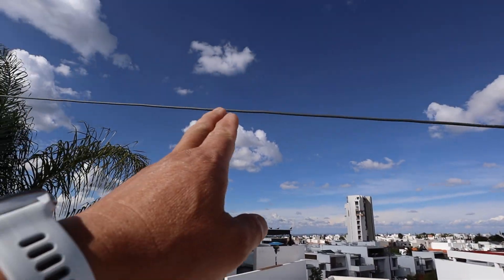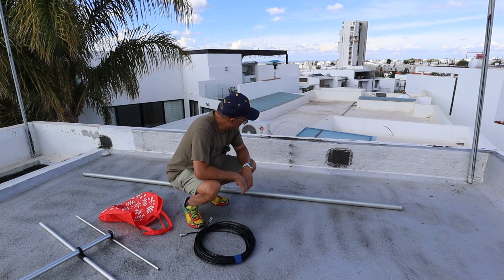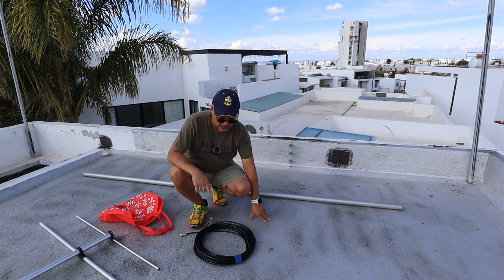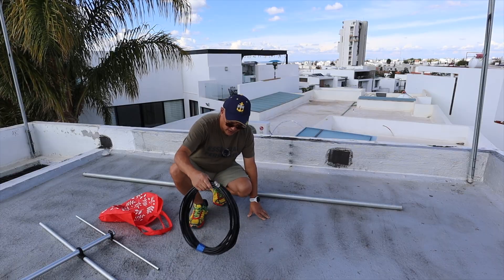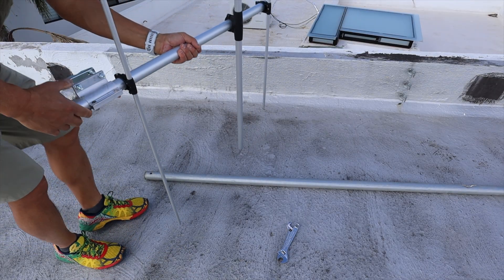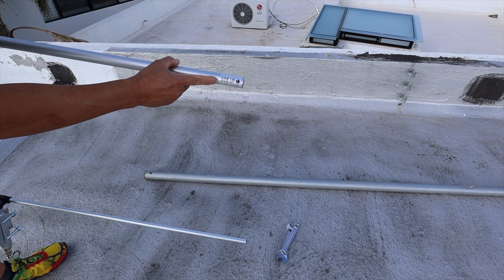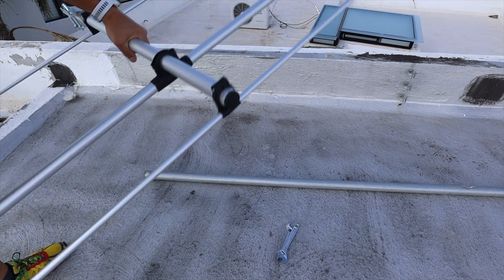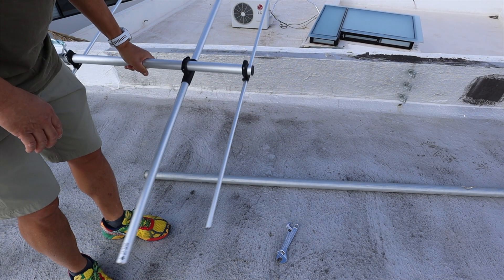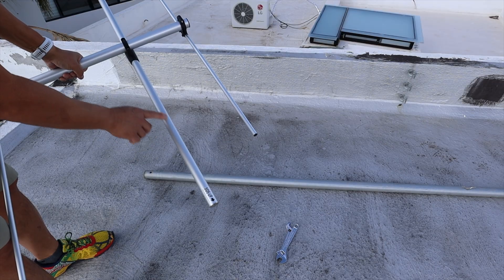It's going to be above this wire here, and I'll be facing it to the northeast. With regards to the coax length, I'm going to run the shortest path straight down to the shack — just under 100 feet of coax. I'm going to have this horizontal polarized just like this. You have to take note: there's a 'this side up' indicated here. The reason for that is there is a drain hole on the bottom. So when you have one of these you have to make sure you orient it correctly, otherwise you'll have collection of water inside that tube.